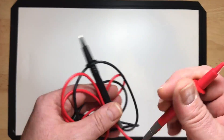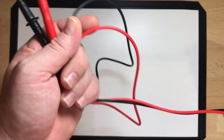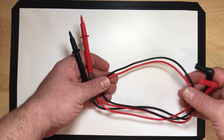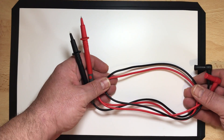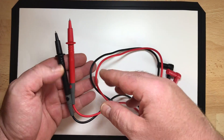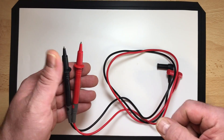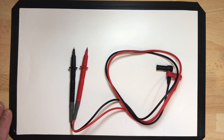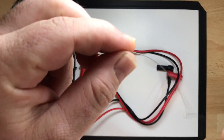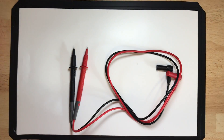No one knows the quality of the leads. Dave Jones also doesn't open or cut them. I should have two of them now but I don't want to cut them. In a video after this one — in a few minutes — I will show you how you can check the quality: not just the plastic or the outer isolation, but how you can check the resistance to see if it is good, thick copper or just a very thin something. Try to put 10 amps over it and you will have a burning disaster. You can check this without cutting it.